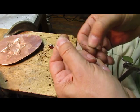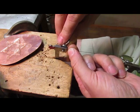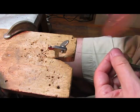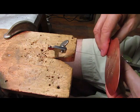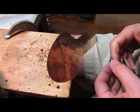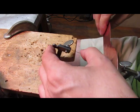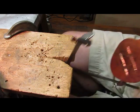I want to make sure that it cuts on the downstroke. I'll put this into the top here and tighten that, and then I will thread through one of my holes the spatula onto this saw blade, putting pressure on the harp to put some tension on the blade. The blade should ping like that a little bit so that we know that it's tense enough.